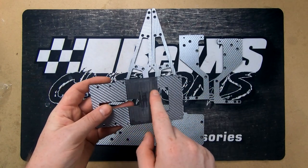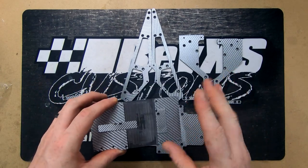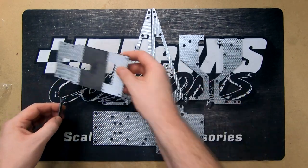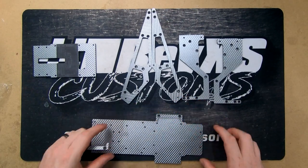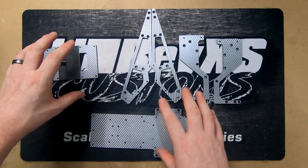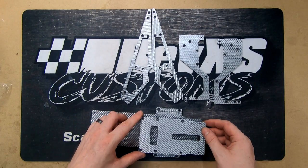We machined the bottom side of this just to make sure the battery fits nice and snug. The standoffs weren't quite the right height and I like my batteries sitting in there nice and tight. We've also got this simple little battery holder — we mount it to a standoff, screw it on, the battery slides sideways in, and then it bolts up at the front right in about there.